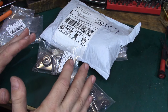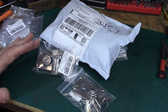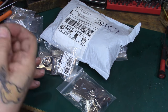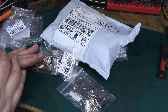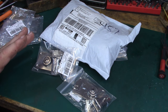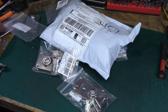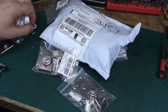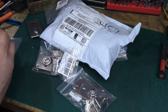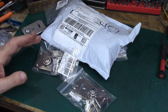Anyway, so to quickly recap before we finish up, the grinding was unnecessary. Simply get under and pry up just a little bit, just enough to get these rivet type things to come forward, grab the head of them with a pair of pliers, and pry them out. So the grinding was completely unnecessary. Fortuitously, I didn't damage any of the plates that I was taking out with the grinding action. The only thing that did get a little bit was this broken piece here anyway. So that doesn't matter. This one, I'm holding on to in case I have a customer with one that needs a replacement.